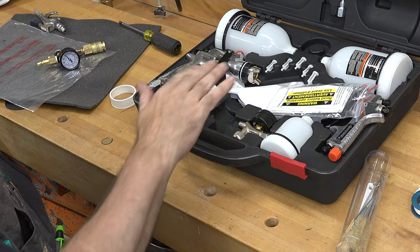But today's experience with HVLP spraying a water-based varnish — I am loving the results. The finish came out absolutely beautifully. It's smooth, it's professional, there are no runs. All I did was spray it on overlapping each pass 50% so it filled in the seams. It dried in about half an hour, which blew my mind. Then I lightly sanded with 400-grit wet sandpaper, wiped off the dust, and sprayed again. The frames, the recipe box, and the wood-burned case all got three coats — and every single one is flawless, silky smooth, and absolutely beautiful. I don't know why I didn't do this sooner.